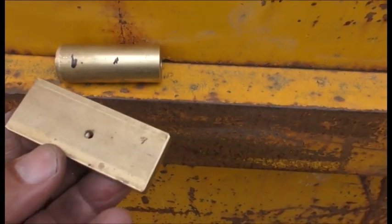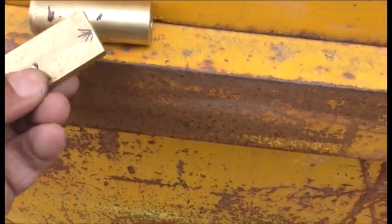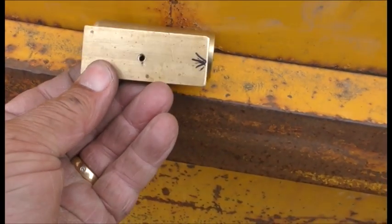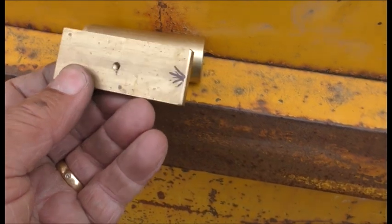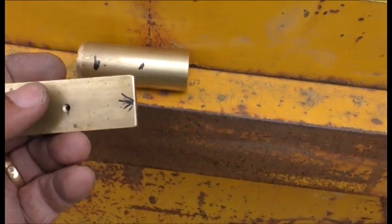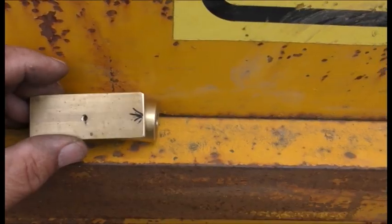I've made a plate and the plate's gonna go this way around like this. I'm gonna get my mate to braze it on, and I drill and tap this one to four mil so that I can put the air screw in there. Let's hope it works out because it's gonna be more or less perfect.